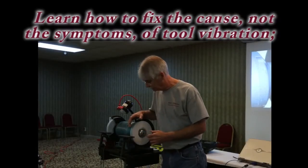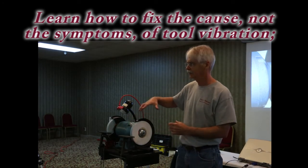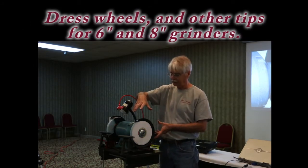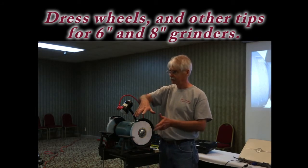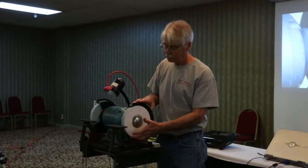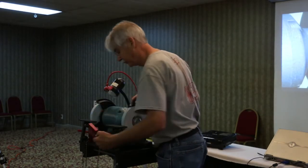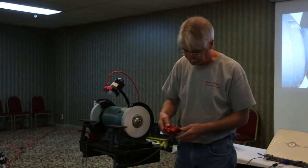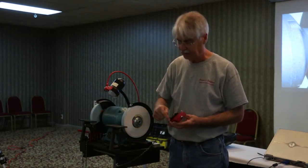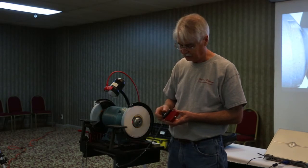Then what we need to do is correct the eccentricities of the circumference of the wheel. Even after everything I've done to make them as concentric as possible, the outside of the wheel can still have a little eccentricity. So years ago I came out with this particular dresser system. What this dresser does a little differently than most on the market is it has an edge guide on it — a diamond point, this is a half-carat diamond, that's adjustable.